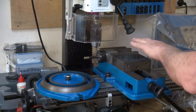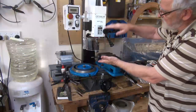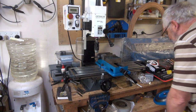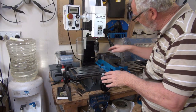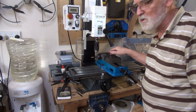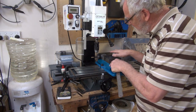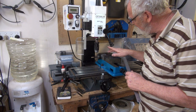Since I put this in and squared it up, I've decided I don't really need the swivel base — I was losing a lot of real estate between the head of the machine and what I was working on. I'm still very happy I got a swivel base because I can use it when I need it. I didn't give you the size of this before — this is a 130mm, 5-inch jaw. I was initially thinking a 4-inch jaw, but the 5-inch fitted okay. It might be a little bit overkill for this size machine, but if it fits, I've got a bigger area to use. It comes in 3-inch, 4-inch, and 6-inch as well, but this is the 5-inch one.